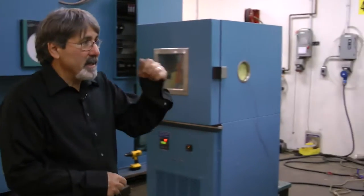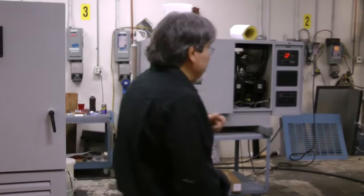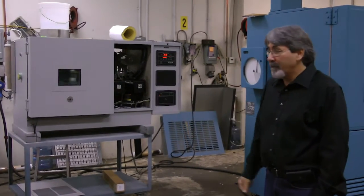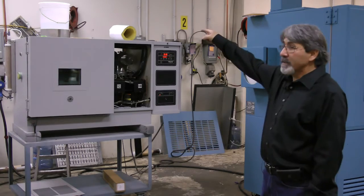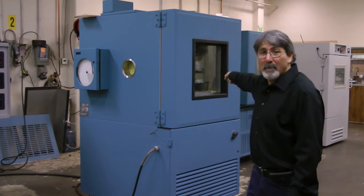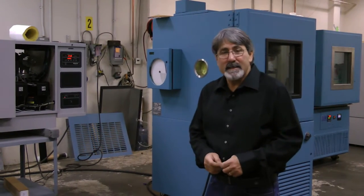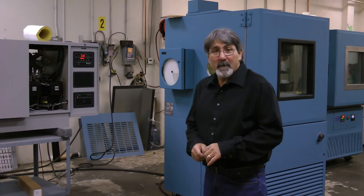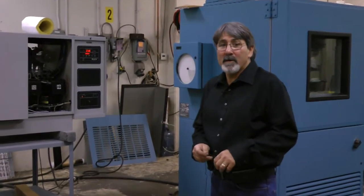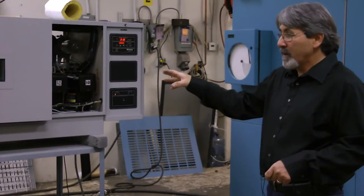After that, if you have a temperature humidity chamber — which we have four running right now — we'll go ahead and simulate and do humidity conditions. Same as our temperature procedure, we need to bring water to the chamber, whether it's through a bucket or a recirc system, which this one has. We hook up our water supply, whether it's distilled or deionized. We always want to keep it between 0.5 and 2.0 megaohms to ensure that the water is not too pure and will hurt the chamber.